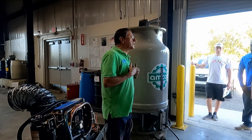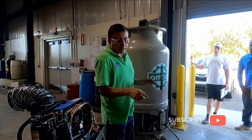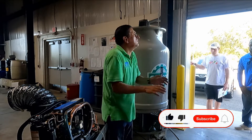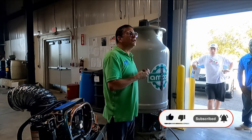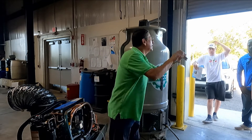Tell them: I am going to connect the cooling tower here and here. Probably they will say no — they prefer it connected at a different point. Ask the manager, because they use those fittings for other purposes. Be 100% sure that at those points you know what is the input and what is the output. Each boat has more connections, so you need to ask them.